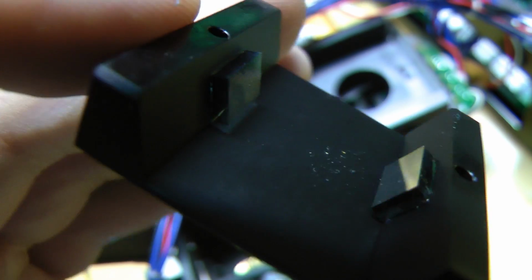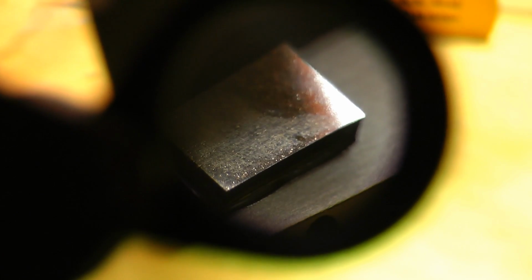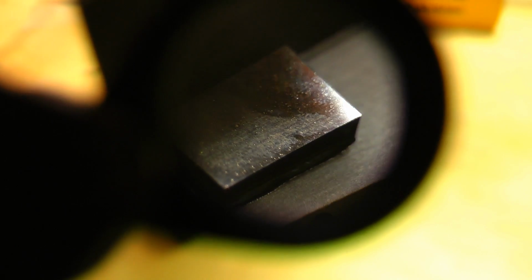Yeah, made by Sony, you can see the bottom there. Probably using Sony image sensors and Sony camera boards. I wonder if there's any dust on this. Yeah, there's a bit of dust. Looks like the mirrors could be cleaned. Looking at this mirror under magnification, it's actually very dirty. I'm guessing that's why it's failing the dust check.